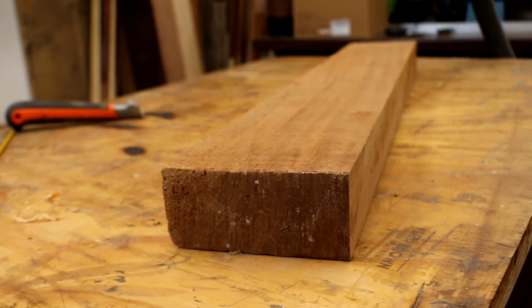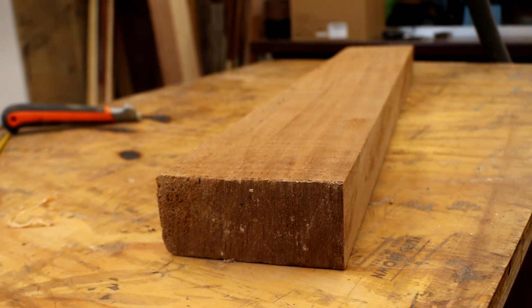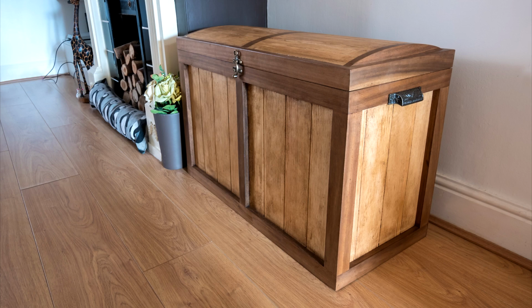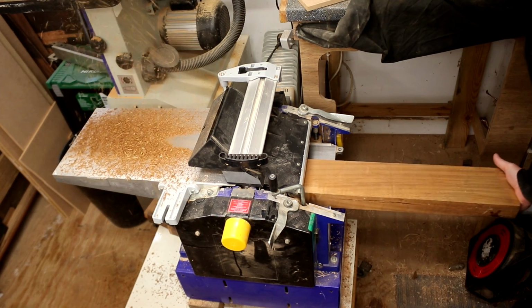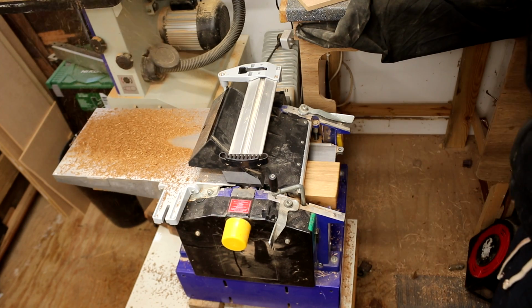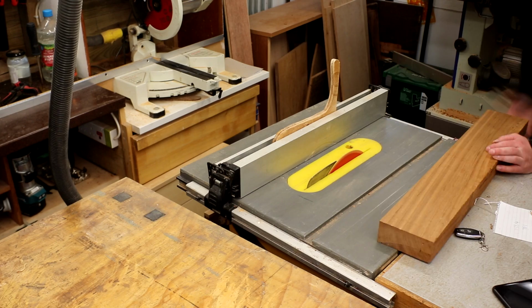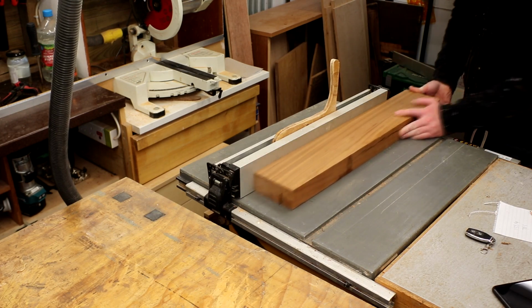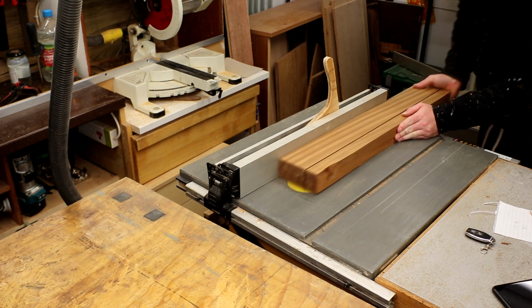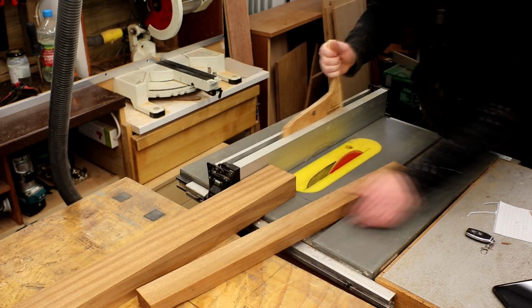For the final project, I started with a piece of sapele that's been in my workshop ever since I made the treasure chest blanket box, which was another build video on my channel. This was rough sawn, but it was nice and straight, so I ran it through the thicknesser just to clean it up. I then ripped it to the width I wanted at the table saw, making cuts to both sides to clean them up and make sure that they were at 90 degrees to the faces.